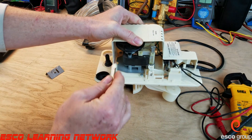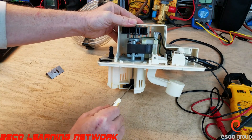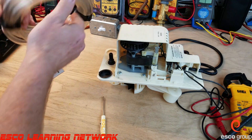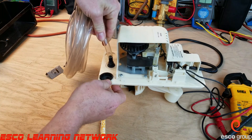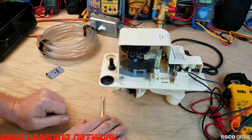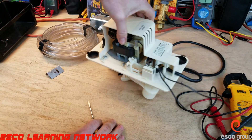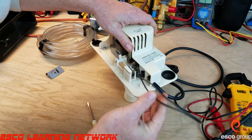The rising float will close the switch and energize the motor. The water gets sucked into the impeller down here and blown out through this barb. This barb is set to receive vinyl tubing — three-eighths or quarter inch. Inside the barb is a ball that acts like a check valve to prevent the water from rushing back down and overflowing the reservoir.